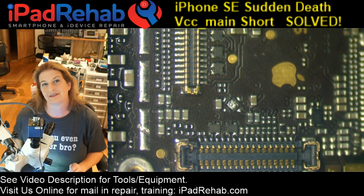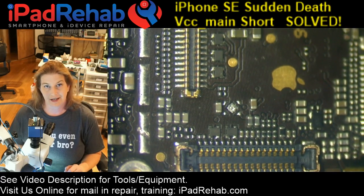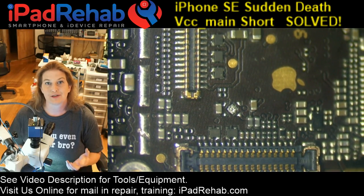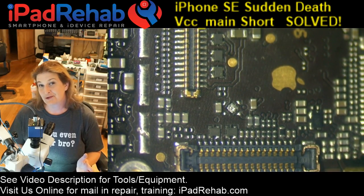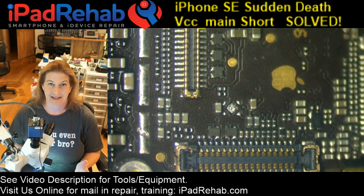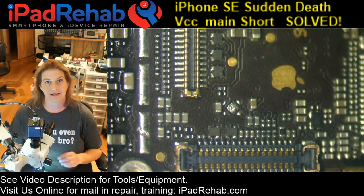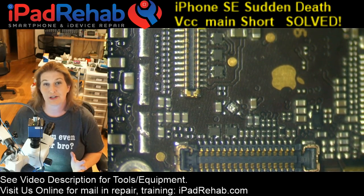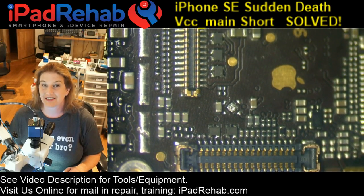Now, the trouble with these kinds of problems is that you have two methods to detect a short. One is mapping visible damage: look for what's damaged and kind of vote the ugliest guy off the island. And number two is, if everything looks beautiful, you can try to use heat and detect heat. There is no other really intelligent way. On iPhone boards, in our experience, using multimeters that can detect very small changes in resistance to figure out where the short is, there's too much noise. We haven't found that practically useful. So our two tools are look for the ugly guy or use heat.